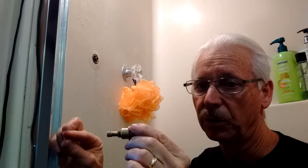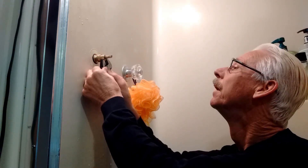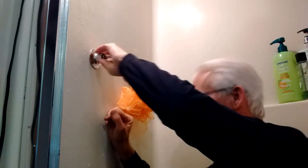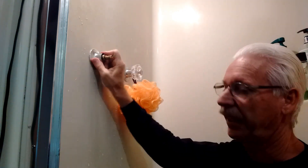I've got to turn that back out. Before you put this back in there, unscrew it out this way — gives you lots of room, then put it in there. It works a lot better that way. I'll get the chrome piece that goes on there, tighten it, and just barely cinch it a little bit more than hand tight. Then put your handle on.